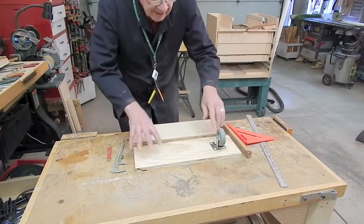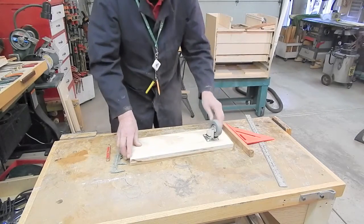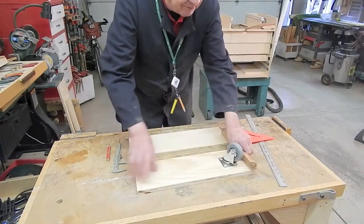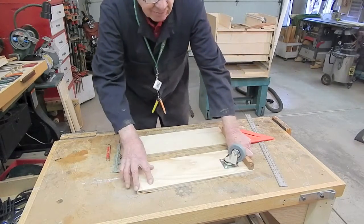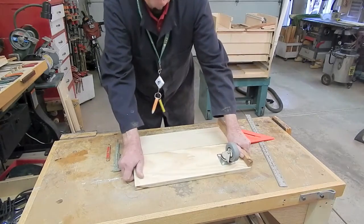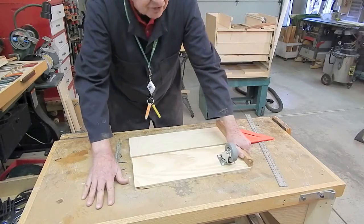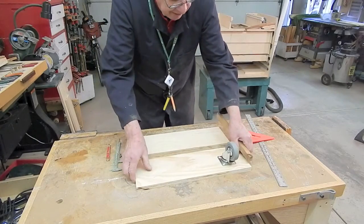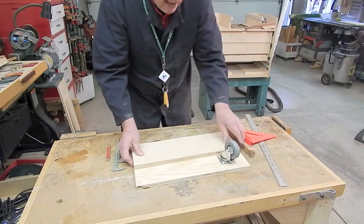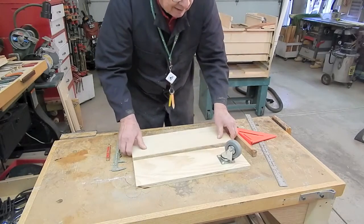The reason for making the caster mounting block a double thickness was simply to make it strong enough, with the actuating arm at one end. My earlier attempt at using just one piece of plywood for a caster mounting block didn't work because the plywood would twist enough under weight that the front of the cabinet would sag and touch the floor. So I needed to double the thickness of the caster mounting blocks, yet have it operate within the same height underneath the floor.